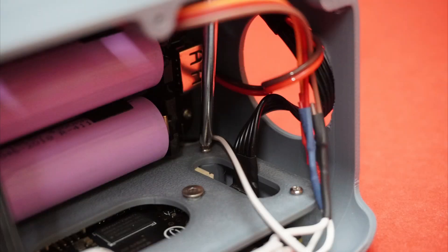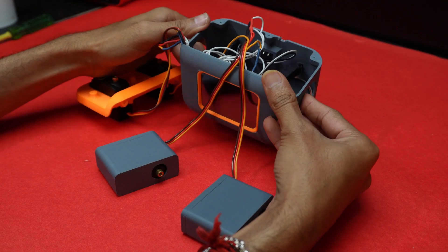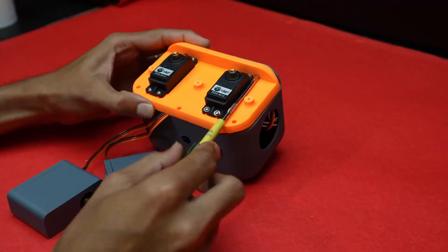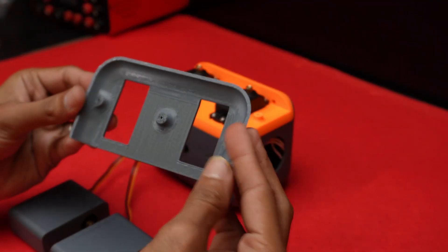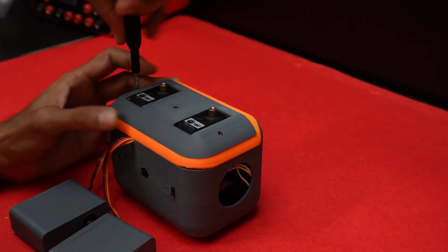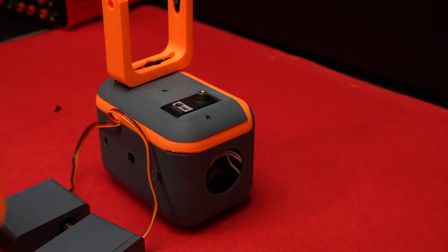Connect all the connectors and assemble the Uni Hiker onto the head. Before mounting the Uni Hiker, make sure you have soldered the 4th servo pin. Use M2 screws to mount the Uni Hiker. Assemble the middle body to the head using M2 screws, put the cover on and use M2 screws. Connect the robot to the PC and run initialize.py to initialize all motors to 90 degrees, then assemble the legs.